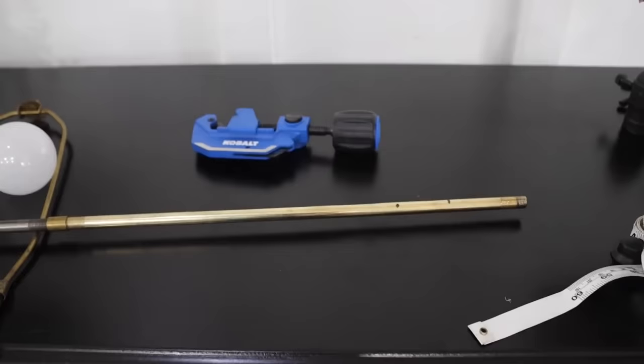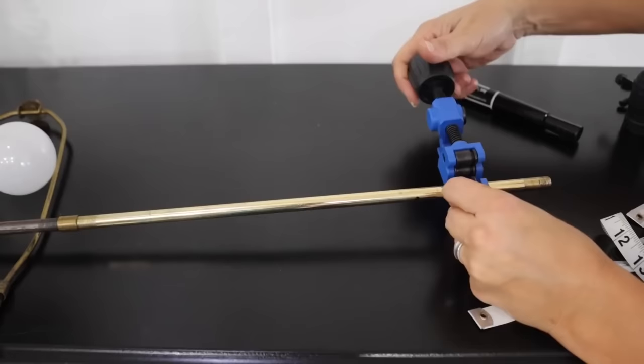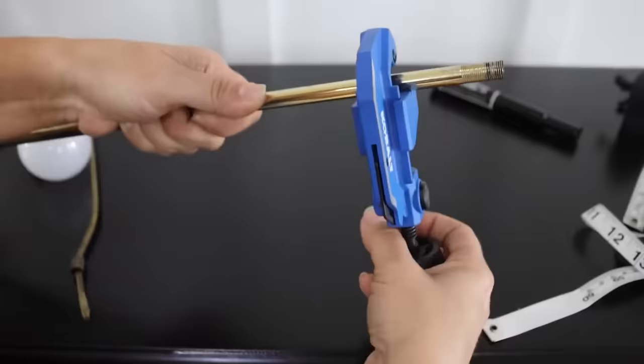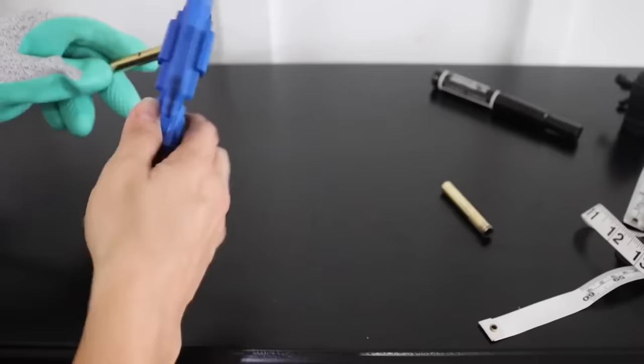It's a little tool that I had in my arsenal that my husband uses and I use, and all you do is you attach it to the rod, line it up with a little blade, and you tighten it and you keep spinning it around and around, tightening it a little bit at a time. As it gets a little bit looser, you tighten it a little bit until ultimately the pipe cuts. And I had to do that twice to get out that 1.5-inch section,